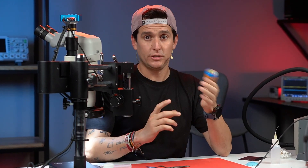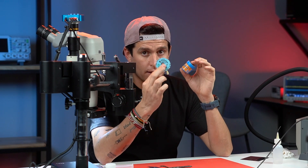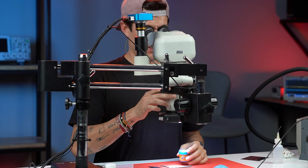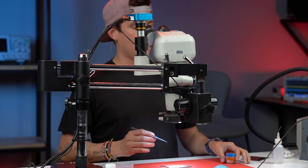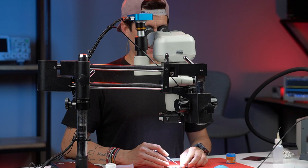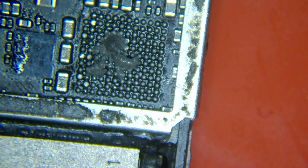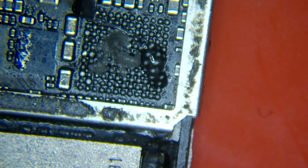The first step to do this cleaning — we're going to use 138 solder paste. We apply this solder paste because it's easy to remove when we use the wick, so it makes it easy to remove the old solder. I'm going to apply just a little bit. Remember, all the tools and things I use in my videos, I'll leave the links in the description. I'm going to clean my tweezer and apply a little bit of flux.